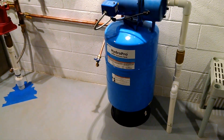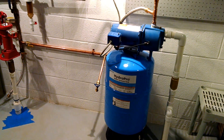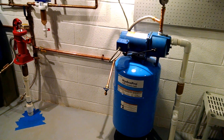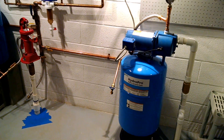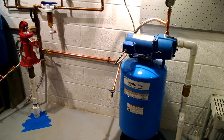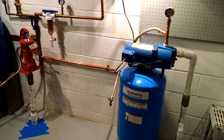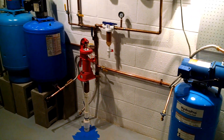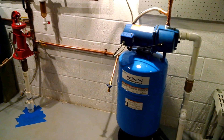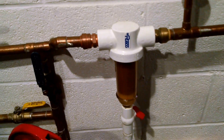This is shallow well water coming from 14 feet below the surface and it actually runs surprisingly clear, but it is definitely not a bad idea to put some filtration on. Anytime I hook up a new well or switch tanks or mess with anything, it kicks up some silt, kicks up some sand. Sometimes if the power is out and the bladder in the well tank collapses, it'll stir up some crap, so you want to have some filtration on the water even if it is nice and clear once it's all settled out.